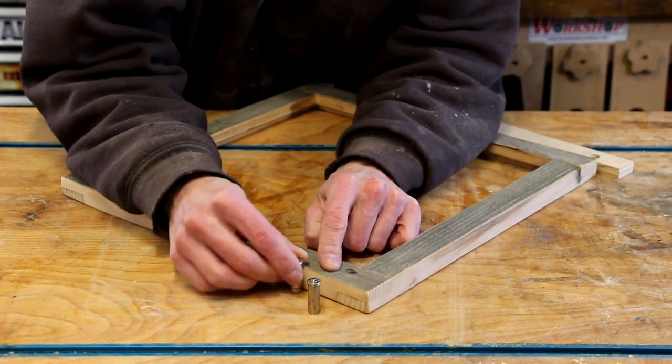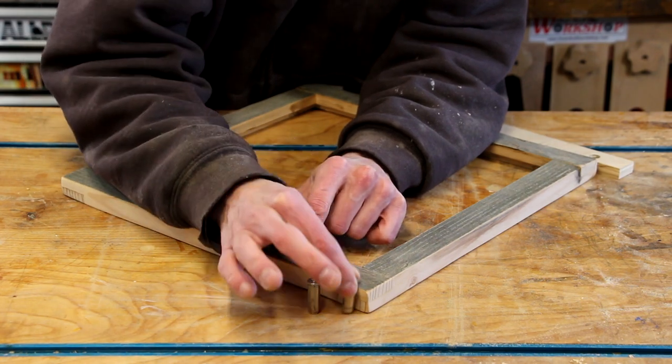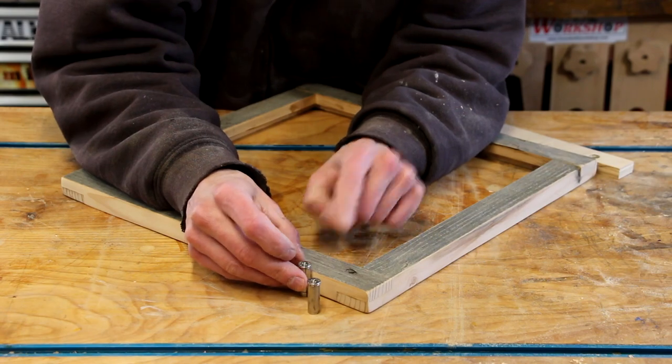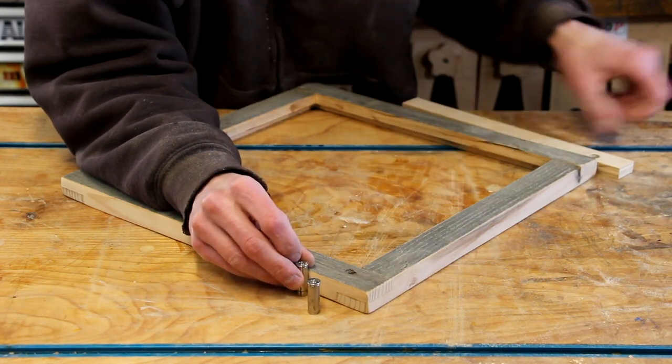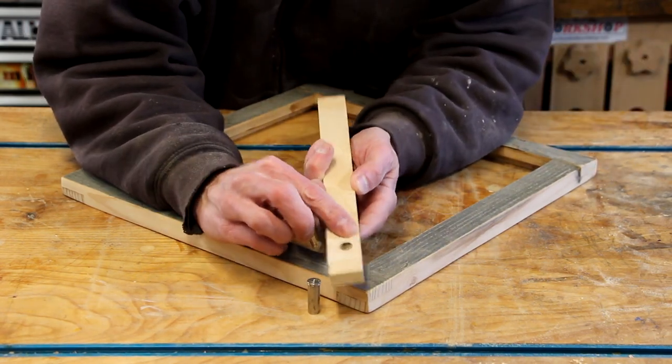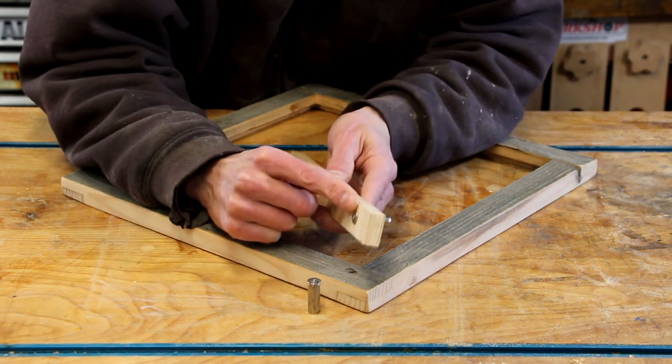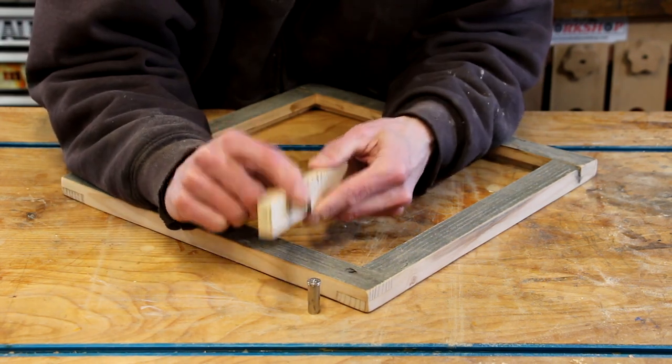You can see right away that these casings are too long. Even if I drill all the way through there's just too much length, so we need to shorten them up — I don't want to drill all the way through. To do that I've drilled a hole in a piece of plywood so they press through, and we can shorten them up on the belt grinder.